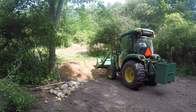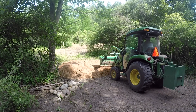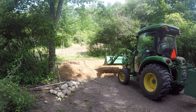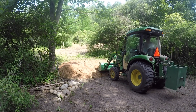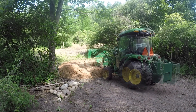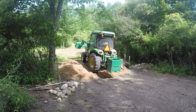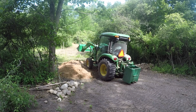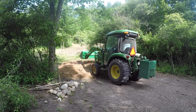In this clip you get a better view and understanding of that elevation change. When I drive the tractor up there you'll see it quite clearly. I'm hauling all the material over and I think I have enough on it, so I'm going to start compacting it. I'm going to use the bucket for that, and drive up on it and use the tires and the weight of the tractor to compact this. One thing to note — make sure you have enough fill material on top of the culvert before you start compaction. You don't want to crush the culvert or add any additional stress to it.